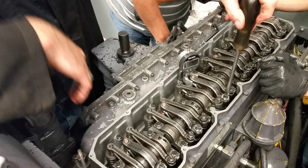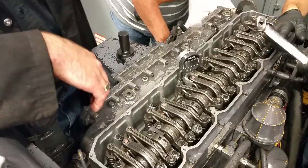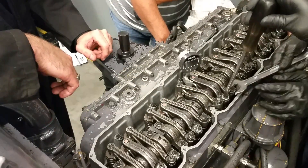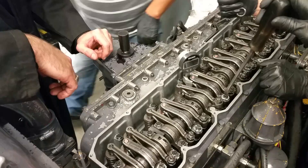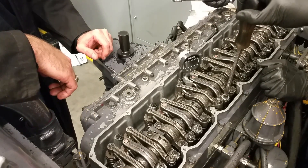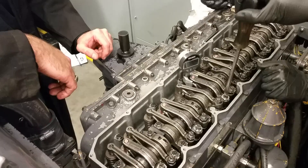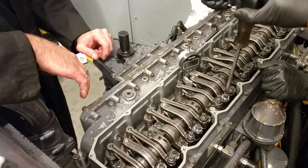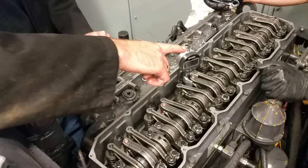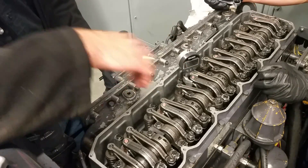Do I have to go up or down on this one? You'll have to go up. So go ahead and make that adjustment to get to 1.88. It'll read negative, but that's just because the plunger is moving out. So we're set.